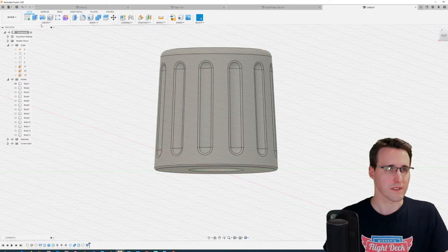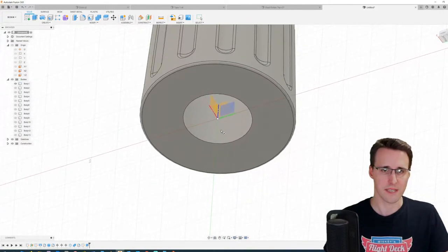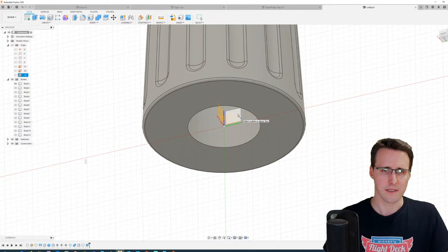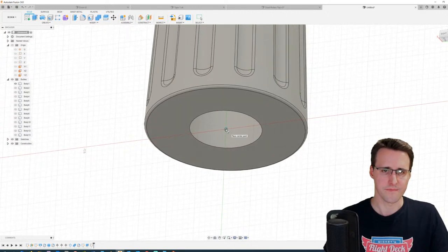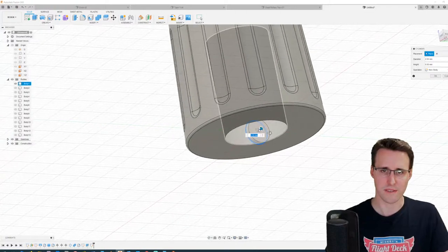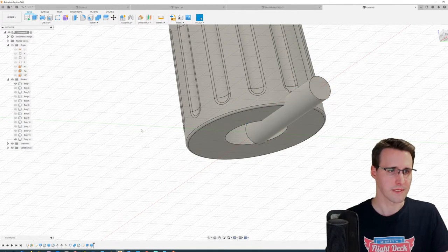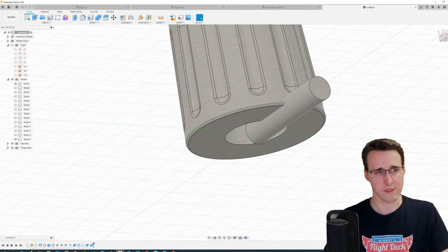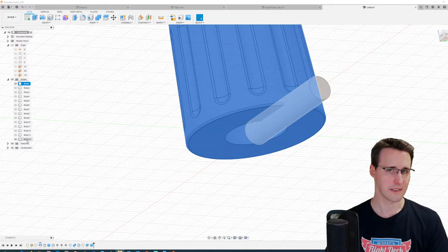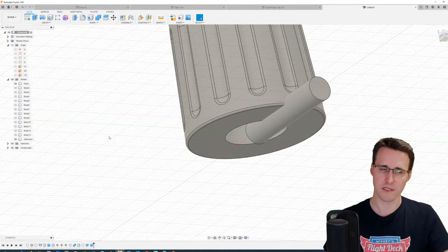Again, we do this using a cylinder as a cutting tool. So create a cylinder on the X, or it's not really important. Let's use this Y, Z plane. And again, 2.5 millimeters is my hole size. And out here. And no cutting for the moment, just a new body, to keep the overview, because you see, we have already many, many bodies here. Let's name it here. Knob. And this here set screw. So we try to keep an overview of what we have done here.